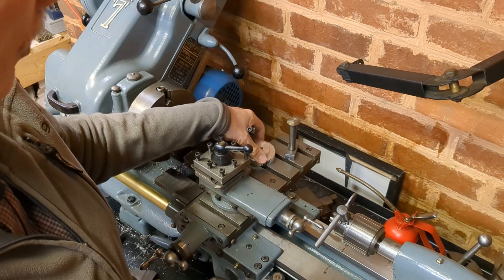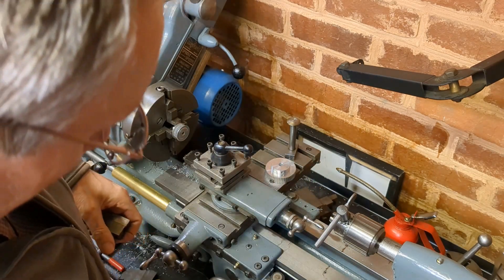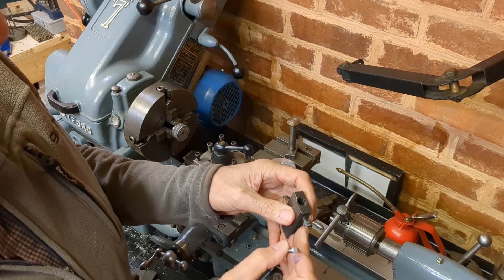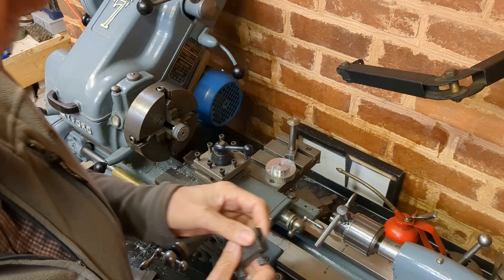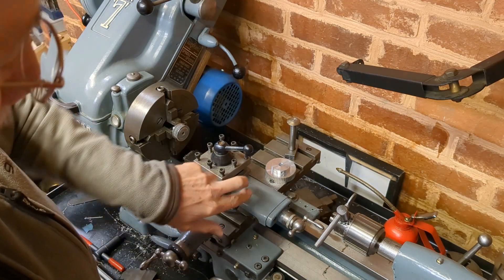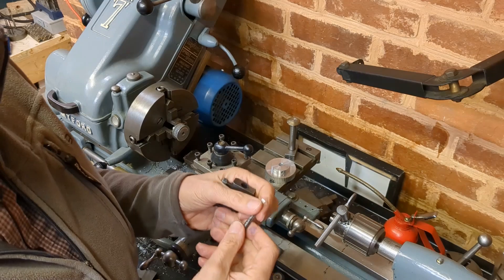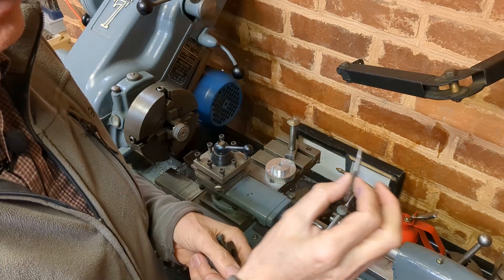However, with these very small holes — this one's six millimeter — I need to open it up. I need to use smaller taps and the smaller taps don't really fit in here very well. I could use longer screws but even if I do that the center height's not right. So I've taken some measurements from the lathe: the center height in relation to the tool post, the gap in here, and the size of my taps which are available to repurpose, and I've come up with a little drawing which we can use to make a dedicated tool holder for this.